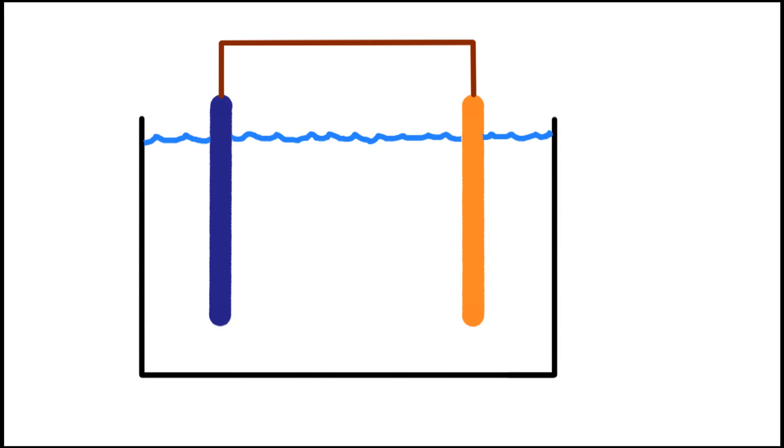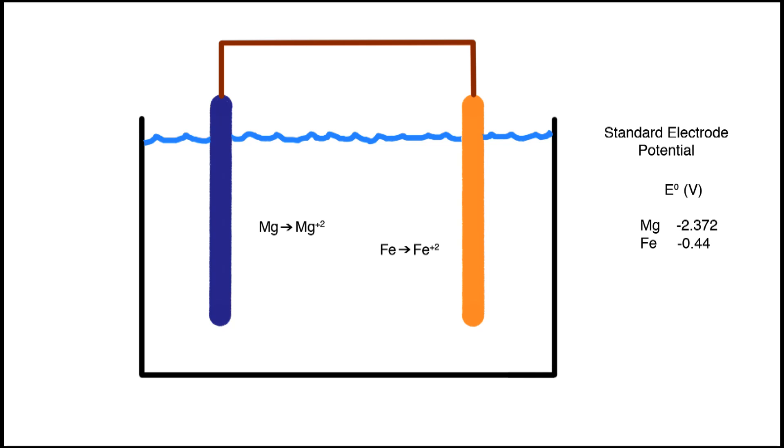But the most popular way to exert a negative charge on exposed iron is to take advantage of the intrinsic energy of a galvanic cell. Here's how it works. Shown here is a water bath with two metal electrodes electrically attached together by a wire. On the right is iron, which represents the iron wall of the tank. On the left is a magnesium rod. The chemical reaction that tries to happen on the right is the first step in rust formation, and the reaction on the left is a similar reaction happening with magnesium. Ultimately, this results in a tug of war between the two electrodes, with both rods trying to give up electrons. As it turns out, magnesium is much more prone to lose electrons than is iron. So the reaction drives electrons to the iron electrode, making that side less prone to oxidation. With the magnesium electrode losing electrons and driving electrons away, that side is defined as the anode, and the iron wall of the tank is therefore defined as the cathode.